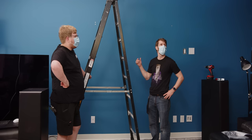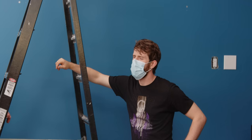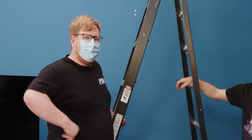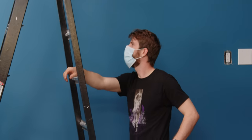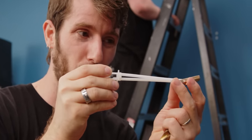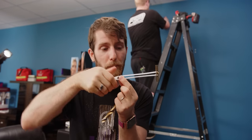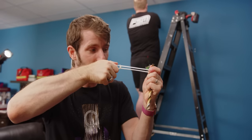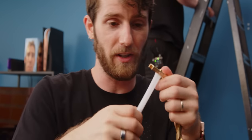I haven't even told you the interesting part yet. The problem with steel stud — if we're mounting a heavy screen, you can't just put a deck screw into it. So what do you do? You've got to get those stupid flangey things. And the problem is steel stud is also not very wide, so you've got to hit it right on the spot. The way the toggle anchor works is you twist it, put the whole thing through the hole, then adjust it so it's vertical to align with your stud. You pull this little plastic tab and it zips — you can see the zip tie teeth there — and it holds it close to the drywall, so you're actually screwing into this pre-threaded hole. That's a strong material. Super cool.